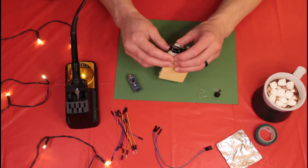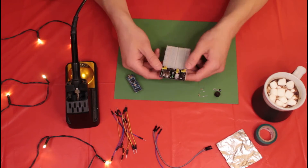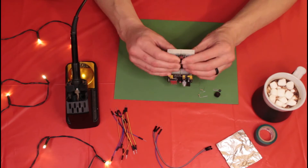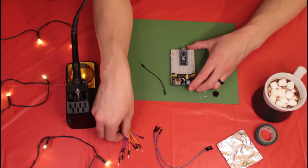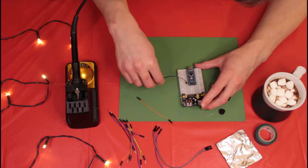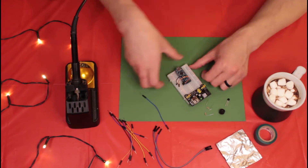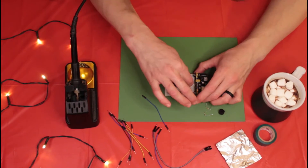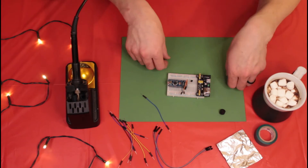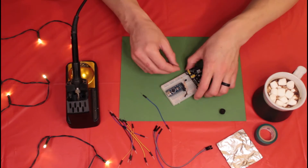Now comes the fun part. We'll start by putting the breadboard power supply on the breadboard — this will provide power to the plus and minus rails on the breadboard on the side. Then we'll place the Arduino board. This is why the Nano boards are handy, because you can put them directly on a breadboard. Now we're going to use some jumper wires to power the Arduino: positive goes to the VIN pin on the Arduino and negative goes to the ground pin. Now I'm hooking up the transistor with the pull-down and pull-up resistors on the emitter and collector respectively.